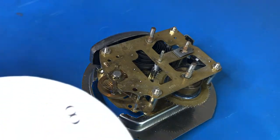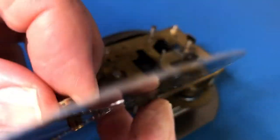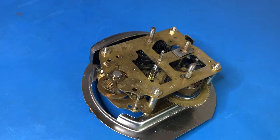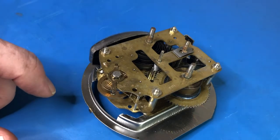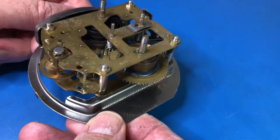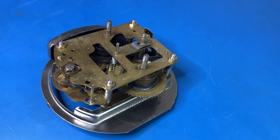Okay, so a couple of things. I'm going to leave this hour hand on, because I think if I try to get it off, I'm going to damage something. And we can see that the hour wheel is lovely and clean, so nothing's really going to be achieved by doing that. Also, you can see that the clock is now running. I just gave it a bit of a spray here and there with contact cleaner, but I gave it a really good inspection, couldn't actually see anything wrong with it mechanically. Basically, what it was just due to a lack of lubrication and or kind of like being gummed up. There just wasn't enough power getting down the train to actually keep the balance oscillating. So it would just oscillate for a bit and then stop. So for example, you can probably see there's sort of like some dried up grease around here. So basically, yeah, this is going to need to be stripped down, cleaned and re-lubricated, and I think it should run beautifully when that is done.